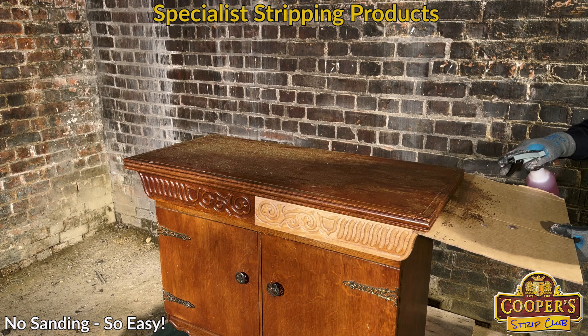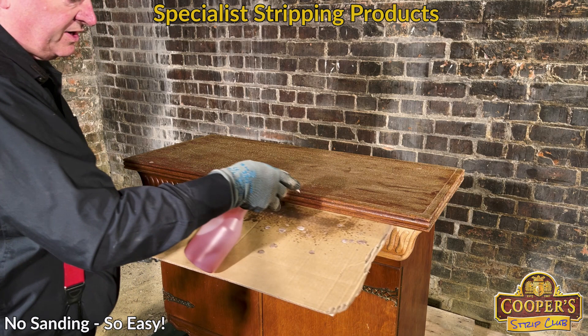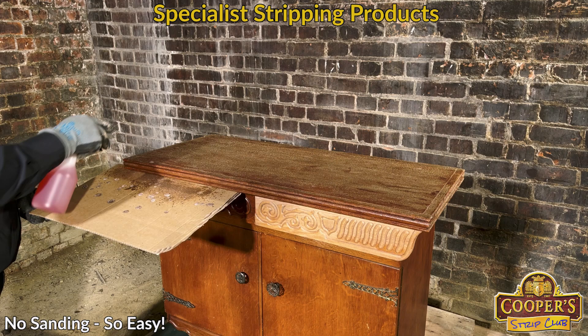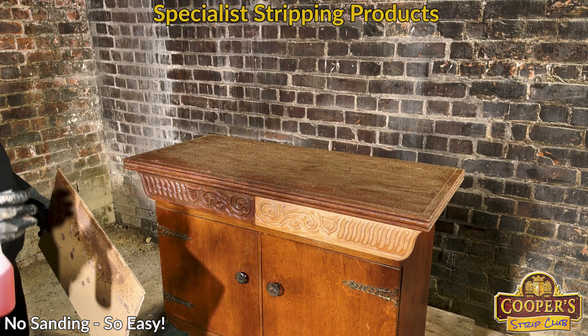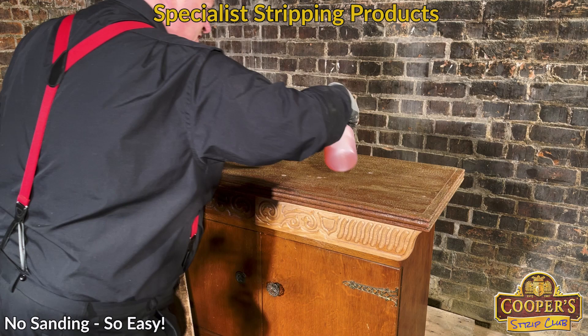This is an interesting finish too — it's not just the original finish. It's had a tinted, sort of chocolatey stuff stuck over the top at some point when they did a bit of a renovation. It's a bit like cellophane, and you lose more and more grain. When I did this other drawer front at the show we were at, the owner was most impressed with just how fast it was. And you're just keeping the surface wet with the stripper as it needs it.